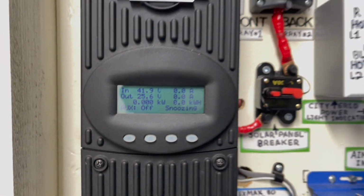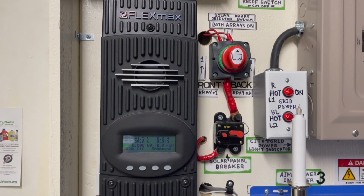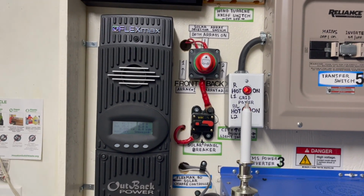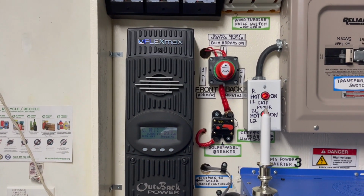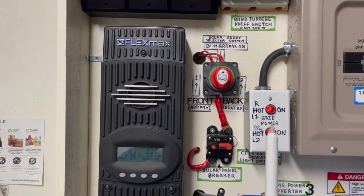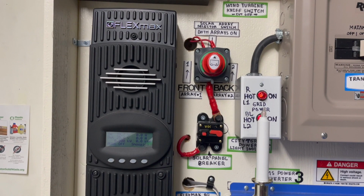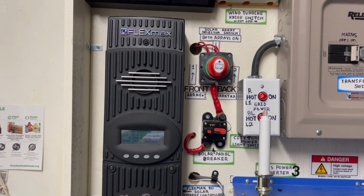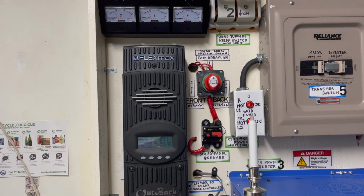Alright, this is usually required on most solar systems right now, because you never know when you might want to do some service on solar panels or any wires coming to right here from the solar panels. And you don't want to get shocked from the voltages that are still in the wires, so you can disconnect it from the disconnect switch outside. So